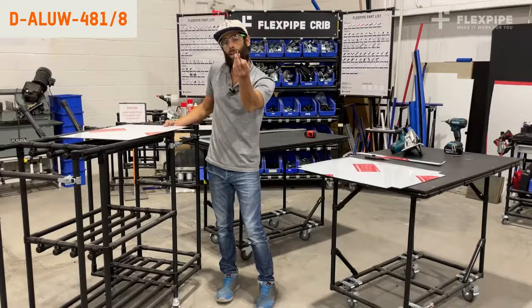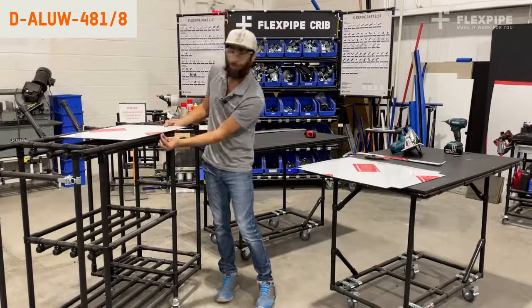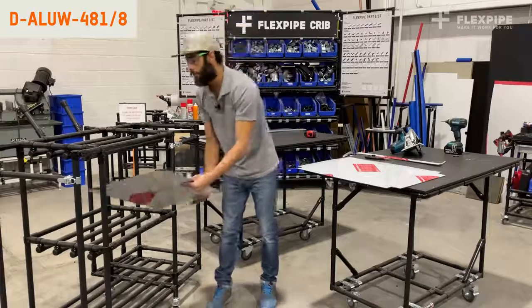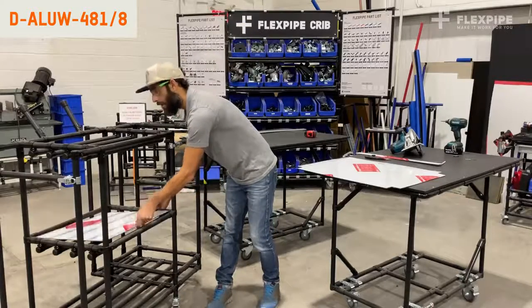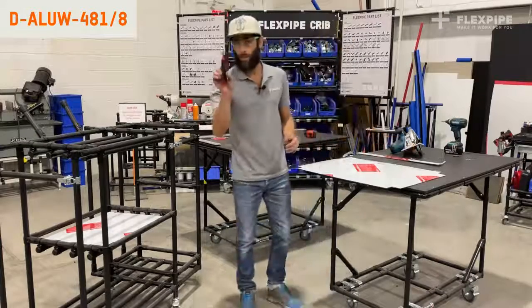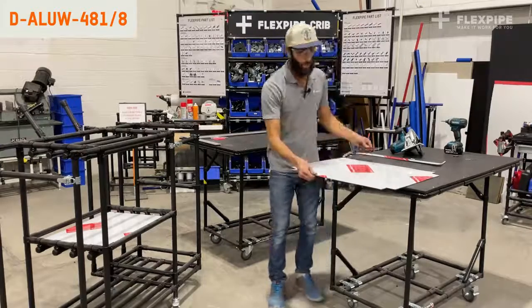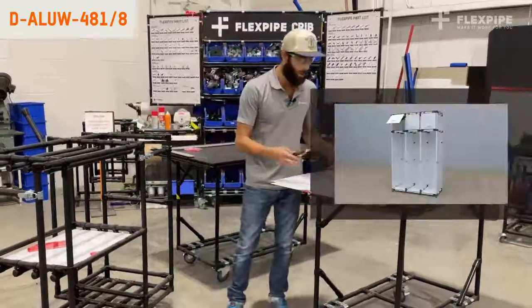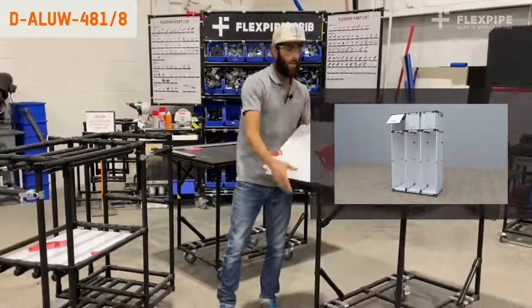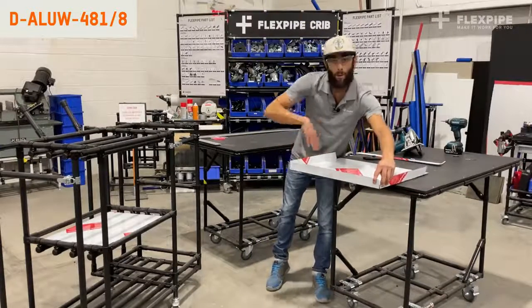We'll have a one inch flathead screw, pierce everything together, and countersink the surface so we have a nice flush finish. That's how we install it. Another cool thing about the aluminum composite is that since it's so easy to cut with just a cutter and straight edge, it's very simple to make all kinds of cool detail work — like instead of just a shelf, making a box shelf where you can screw the sides and have a barrier.